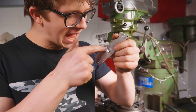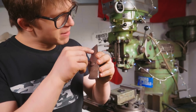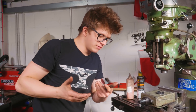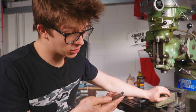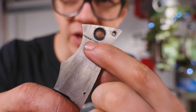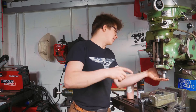I have taken the ball end mill and gone in here. I center drilled, then drilled a four millimeter hole right there. I marked off with a center drill where our spring cut needs to go down to. I then scribed across at 90 degrees with the thing spinning - which I should just take it easy on trying things, it didn't work too well - but it still shows me what's square and it's about to be cut out anyway. We're going to cut it out with a slitting saw, our old friend the slitting saw.